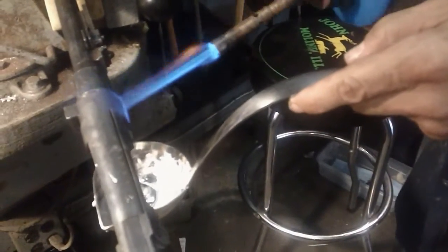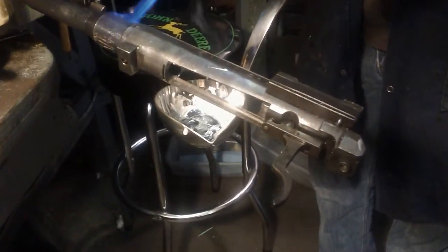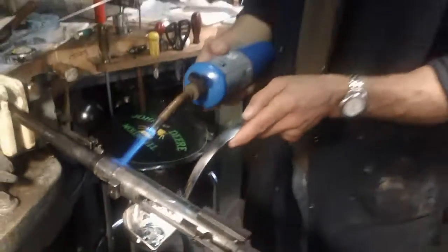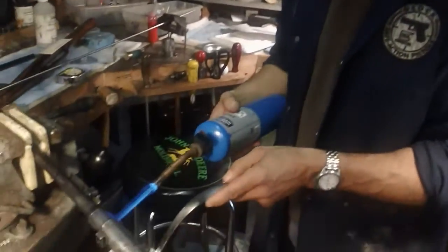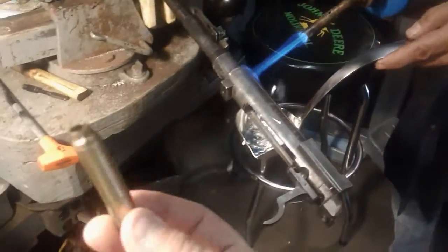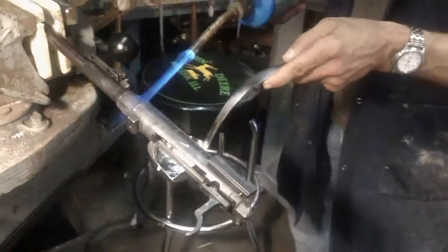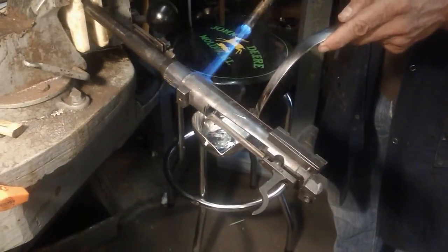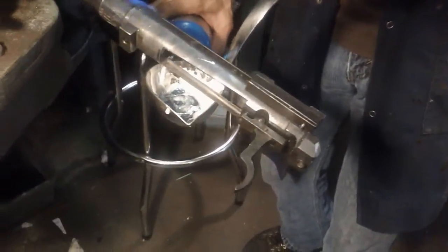So Scotty, what are you doing right now? Well, we attempted to cast this chamber but I was kind of afraid this might happen — there's a burr up in there and it's causing the casting material not to release. What I'm gonna do is melt all this back out and clean it up, and just declare this gun needs to be re-barreled. Somebody really messed that chamber up, as you saw with that deformed empty shell. The casting got up under the deformities and it's holding on. You can see it's even split the brass — most times it'll just tap right out, but in this case it looks like somebody took a big drill bit and opened that up and really gouged it up pretty bad. They really ruined that barrel.